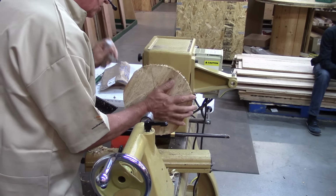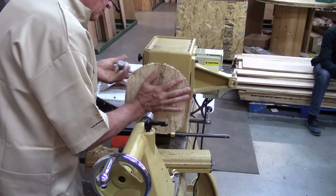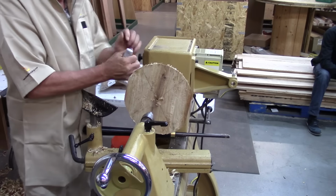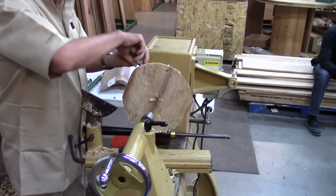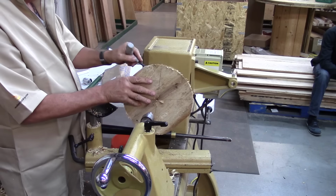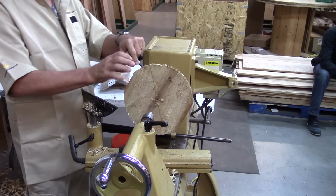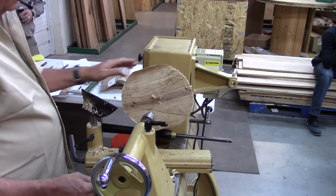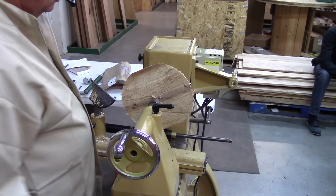There's one on the outside, a shear scrape that he does that gets things very, very clean. And then there's a cut that he does on the inside, and that is literally like skew working on a spindle. The thing that's true about this is I'm a left-handed turner, and it's a right-handed cut. What I learned in an afternoon was how to be a right-handed or left-handed turner.